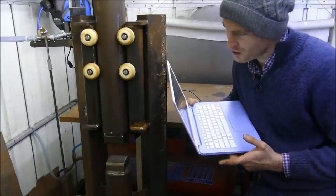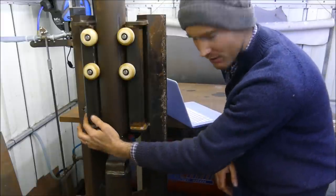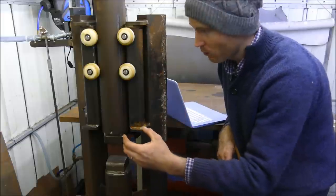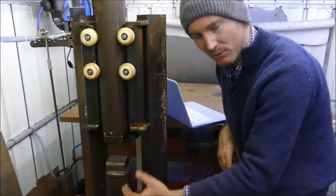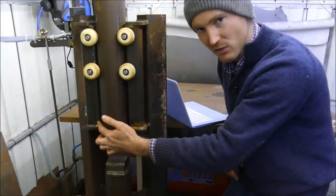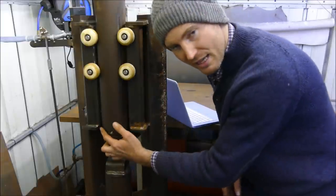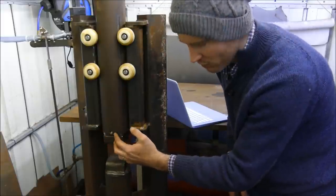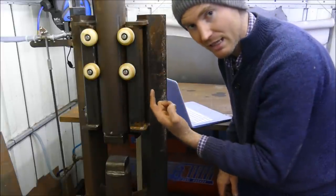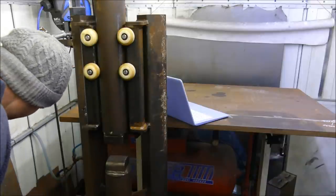So what I'm going to change here is, as the head comes down, it engages with the sensor. As soon as it's engaged, there's normally a delay of time where it's pushing the cylinder head down before it returns back up. The moment it returns back up and disengages with the sensor, it then repeats that process again. And the sensor is strategically placed so that its momentum doesn't carry on up and overextend the cylinder. But just so we can see the comparison, this is how it's operating currently. We turn it on.